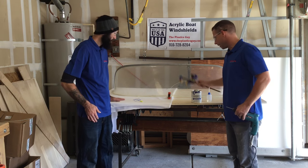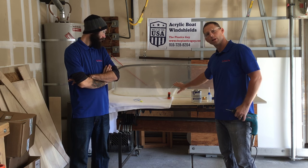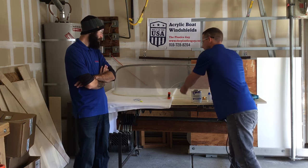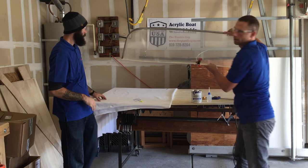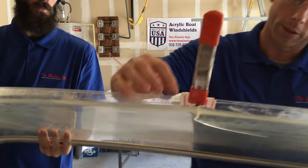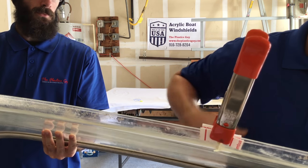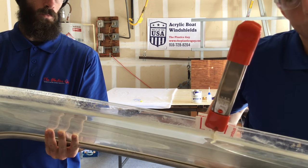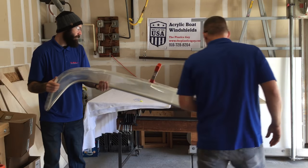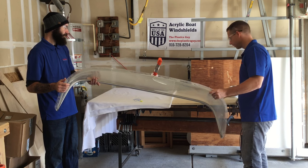We also have — you could use these press clamps or just a grip clamp — to hold the crack in place while we're doing the repair. I also cut a couple of little shims that we use between our clamp and the actual plastic, and that's to prevent the glue from sticking to the clamp. I'll show you what we're going to do with those. So now that we have all our products ready to go, we'll take you through a step-by-step demo of stopping this crack.